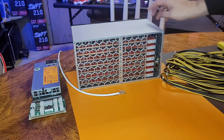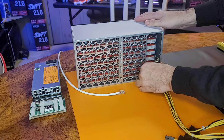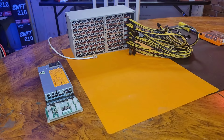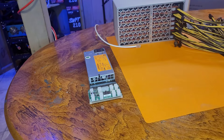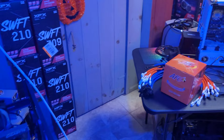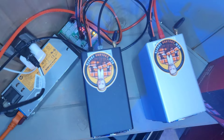For the algorithm that we are focusing on, we only need to put one six-pin to each hashboard, except for the two that have the fan control wires — those two boards get two six-pins. And as soon as I plugged that ninth wire in, I knew we had a small problem: this breakout board only has outputs for eight six-pins. Luckily, back over here we have a bigger breakout board on a server power supply running just two box miners that we'll be able to utilize for this just fine. Perfect!